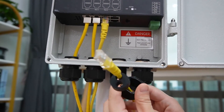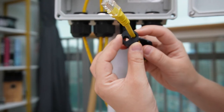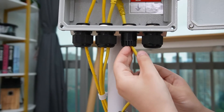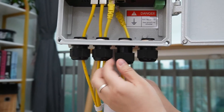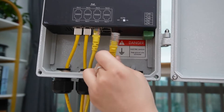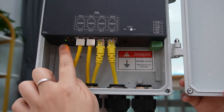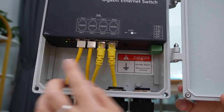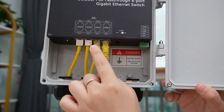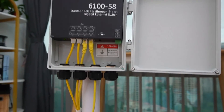Now I'm going to plug in the ethernet cable from the PoE adapter. There's a gland with a rubber seal here, so we don't need to worry about water getting in — just twist it, and when you do the installation, you can also use a wrench to fasten it up. Let's plug it into port number 8, and instantly we can see the indicator light is on. The PoE pass-through switch is now getting the power and data it needs, and it's going to supply three of our bullet cameras through this single ethernet cable.